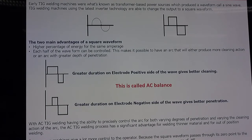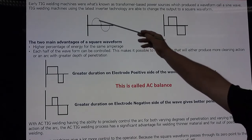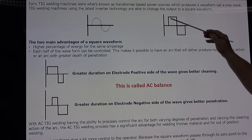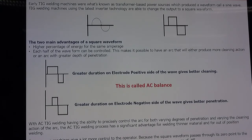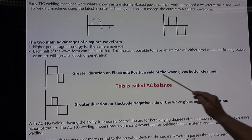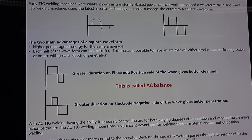With different technologies in welders today, we have different waveforms compared to old AC welders. In the old days, we had a sine wave. The new machines, like the BW-T200 AC-DC, have a square waveform. This has several advantages — first, we gain a little extra energy in the corners, meaning what we used to do at 100 amps on the old sine wave we can now do with 85 amps on the square wave. The other big advantage is the ability to play with the AC balance dial, changing how energy is distributed between the workpiece and the tungsten.